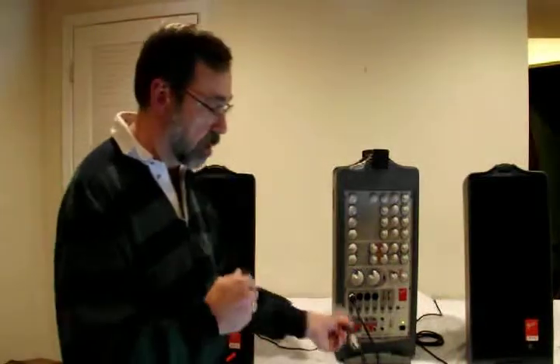Make sure in your arrangement of speakers and microphones that no microphone's throat — the boresight — is pointed toward the speakers, or you'll get feedback. It's your job as the sound person to ensure that orientation avoids any feedback. If you do get feedback, immediately turn the volume down on that mic to make sure it doesn't blow the speakers. The bigger picture is making sure the arrangement of microphones relative to speakers is in the correct location.